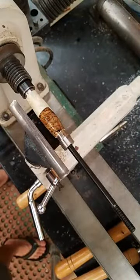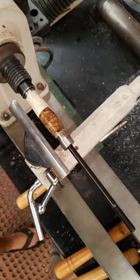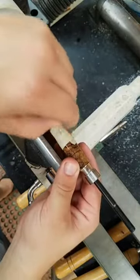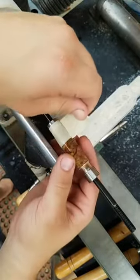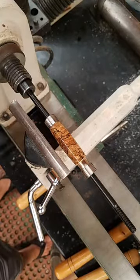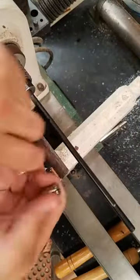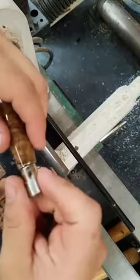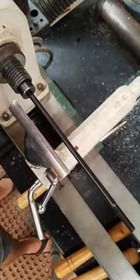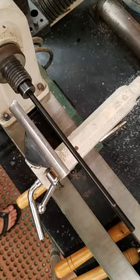Okay, so what we did here, just have to tweak a teeny tiny little bit, but we put the bushing in the one side and taped it on flush with the other side, masking tape so it doesn't screw up your finish. We placed some smaller bushings inside. So they would leave this pressed out a little bit so you could get in between. And then trim it off on the lathe. That way you know you're ending up straight.